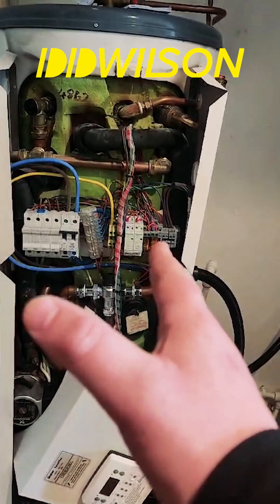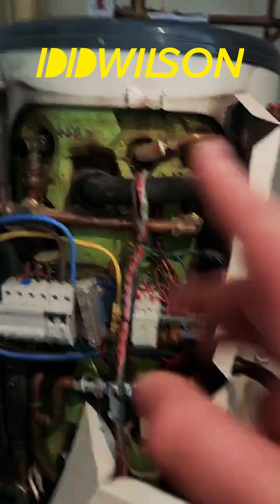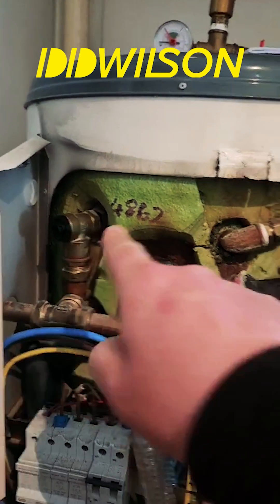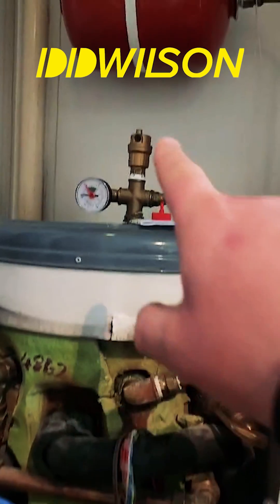The reason for that is the water inside these pressurizes and can become fatal - like a bomb - because when water heats up it expands. It needs safety features should it fail to expand correctly where it's meant to expand. Should the expansion vessel fail, it has safety features called pressure reliefs. What Tishton found is that the pressure reliefs are broken.